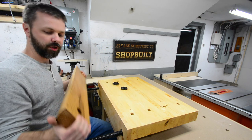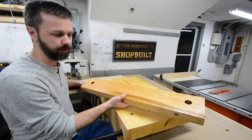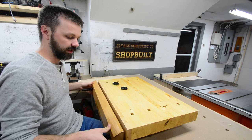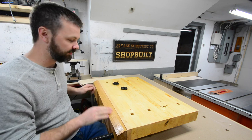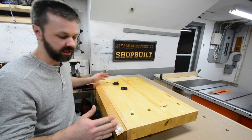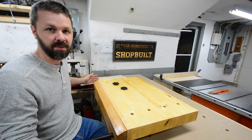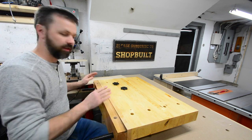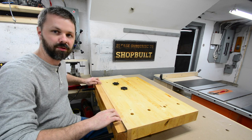For the movable jaw, it's pretty simple — mine is a piece of oak. I flattened it with a hand plane, drilled the two holes to line up with the threaded rod, and beveled one side, which was kind of a mistake. I had two ideas going: I wanted bench dogs, but I also wanted the bevel so when you're cutting you can get a little room. But I forgot you can't really put bench dogs in a bevel, so I should have left the ends not beveled. A simple fix was to drill the dog holes on the back side. The only extra thing I had to do was glue a strip onto the bottom just to get it up high enough, but now I can use my dog holes.